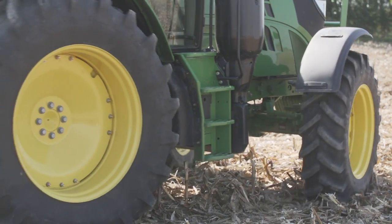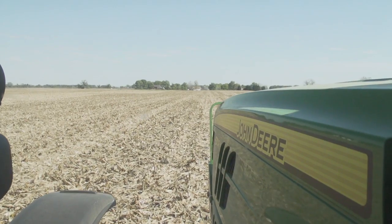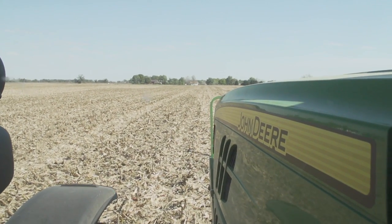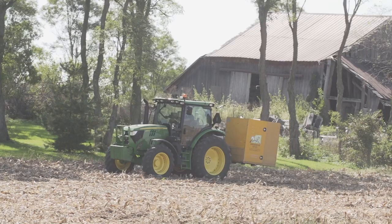So that was one of the challenges we wanted to solve with our system — how can we take very consistent and very accurate soil samples every single time and take all the human element out of it, so we can eliminate as many problems as possible. The other problem we run into is, we went from doing whole field sampling to zone sampling to two and a half acre grid sampling, and we still saw a tremendous amount of variability from point to point. So our solution to that is how can we figure out a way that we can take lots more samples, lots more data points, so we can rely less on interpolation methods and more on actual sample data to do a good job of modeling what actually is going on in the field.